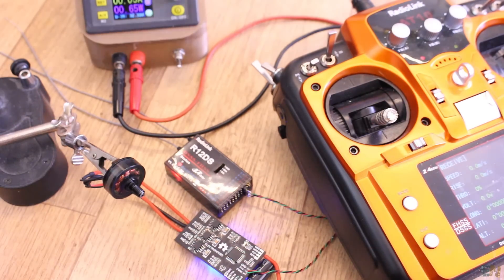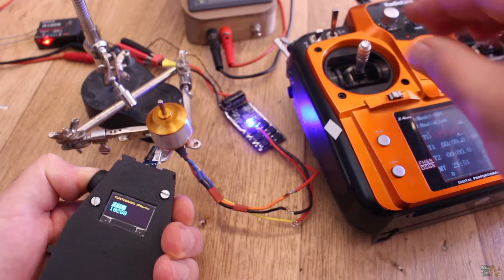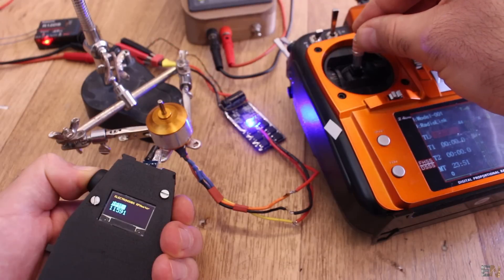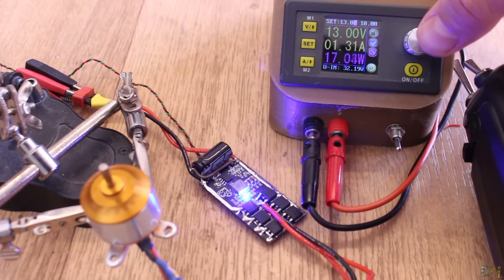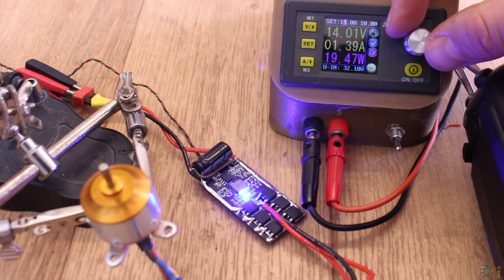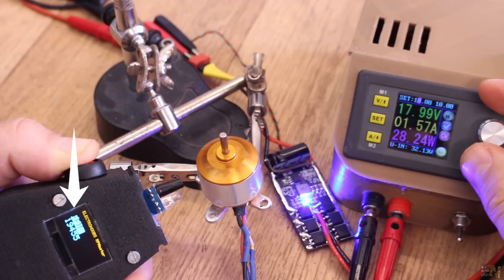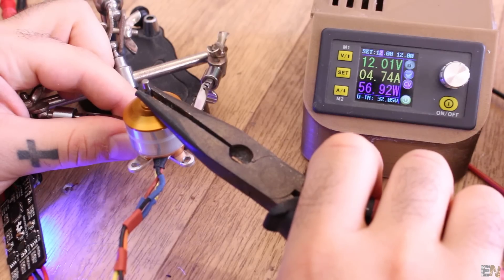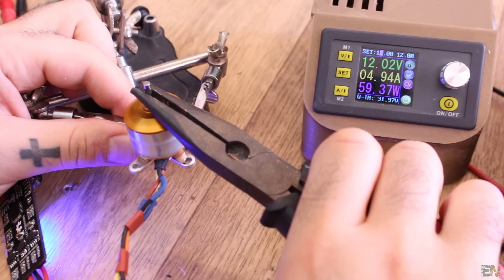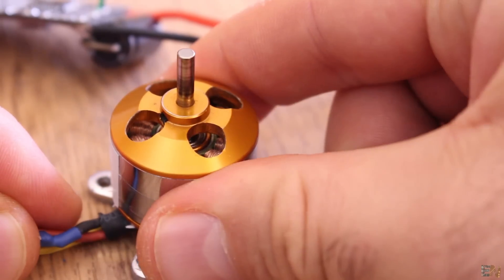Now let's see the maximum speed. I apply a white strip to the outside of the motor and use my RPM meter from a previous tutorial. I get a speed of up to 14,000 rotations per minute, using a supply voltage of 13V to simulate a 3S battery. This board could work up to 4S batteries. I then increased the voltage up to 19V and it could reach up to 20,000 rotations per minute. By braking the motor I was able to get current spikes of over 10A and the MOSFETs were not even hot — the brushless motor did get a little hot, but not the MOSFETs.